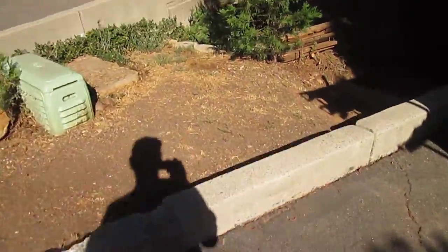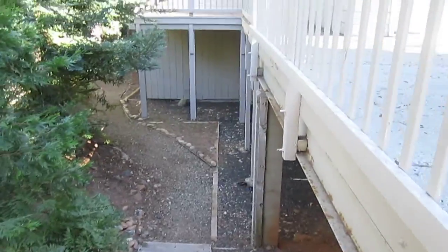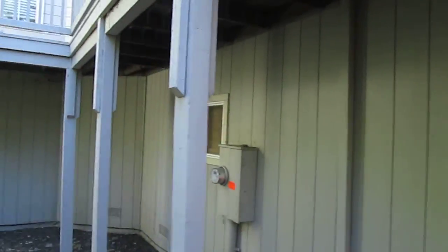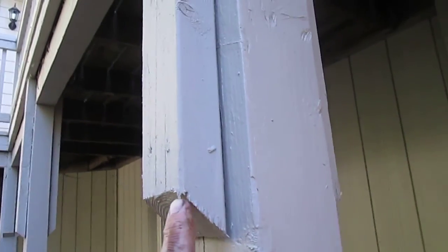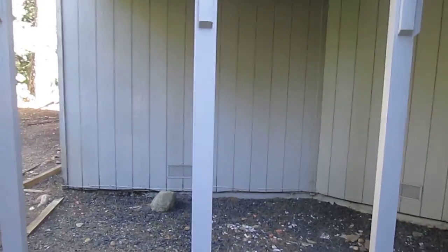Real primer. I don't use interior house paint. I don't use 2 coats of paint. I use Zinsser primer, the best you can get. I have a warranty for 2 years. On this I-beam it'd probably have to be scraped and primed as well, since it's metal. Up underneath, nothing. Underneath here, nothing. I would just leave that exactly the way it is. Again, with the caulking, we caulk these guys in. We take great pride in what we do, so we seal houses up.